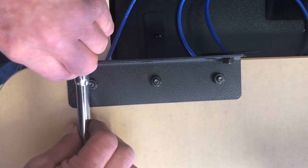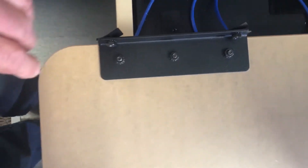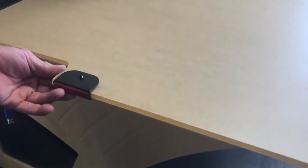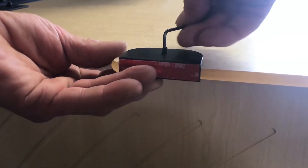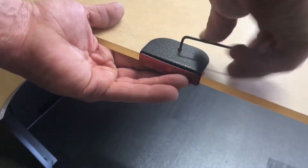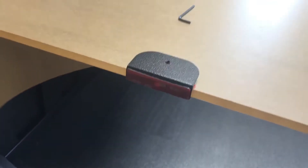I'm going to leave these a little bit loose, just so when I slide it into the channel. I'm going to go ahead and install my brackets. You just want to snug these up — you don't want to crack your plexiglass, it's easy to do. Again, one to two foot-pounds of torque on these. Be careful not to crack your plexiglass.